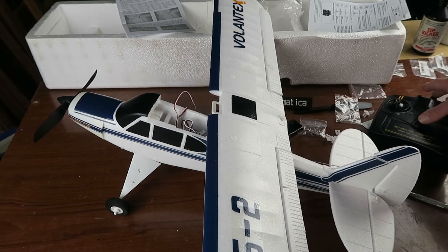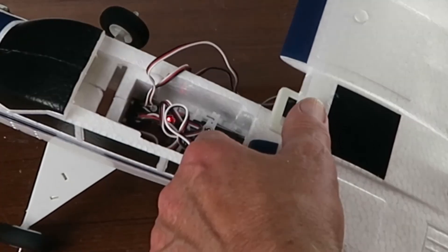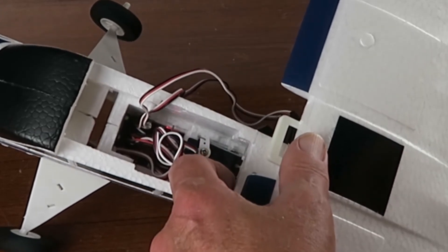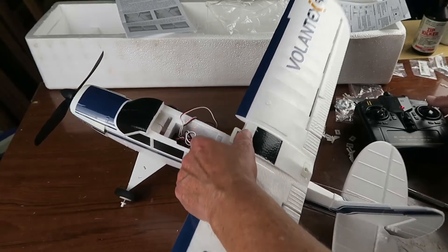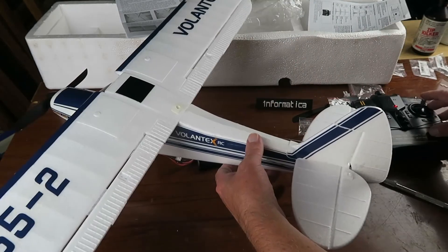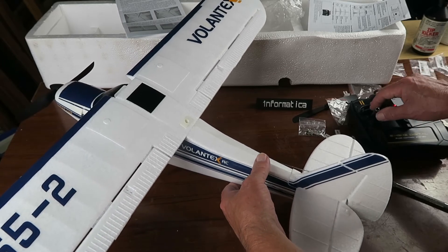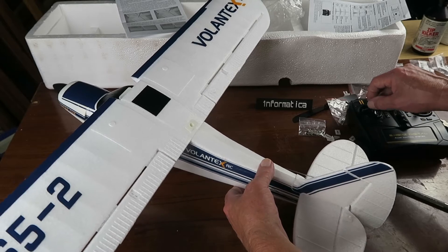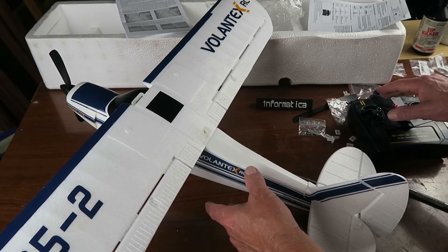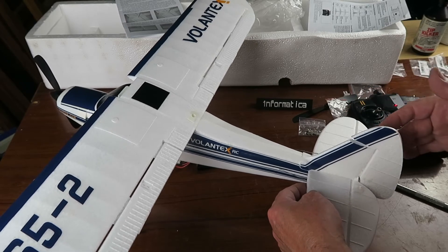Let's just apply some power now. We'll turn the transmitter on. Battery connected now - we have a flashing red light. Let's try that again - turn this transmitter off and on. Now we have a solid red light and we heard the servos initializing. We can hear the aileron servos moving; haven't got the controls on there yet. Elevator is functioning. And the rudder. Finally, if we arm the motor - yep, plenty of power there. Now that I know the electrics are working and wired up correctly, I can go ahead and put the final linkages and control horns on.